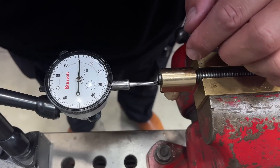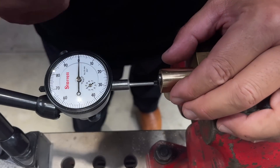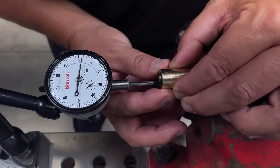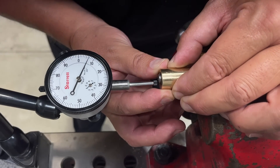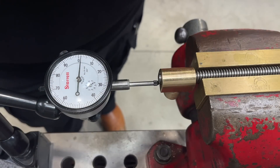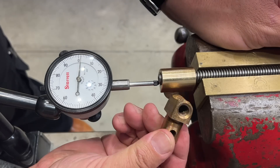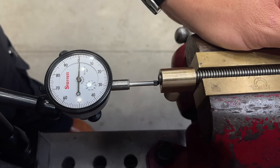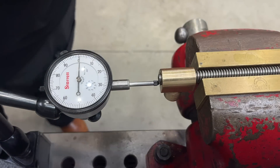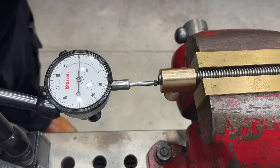Here's our quick bench inspection with the new nut that we ran the tap through. I don't think there was a whole lot gained here. I know it's going to be better, but I'm getting approximately six to seven thousandths — not really consistent. So we kind of took the play in the old nut and cut it by half approximately. It is some improvement, but I'm just not sure if it was really worth replacing this, considering it's still got six or seven thousandths in there — and that's based on the inexpensive tap we bought to do the job.